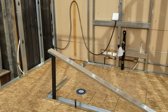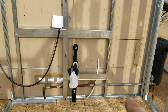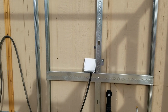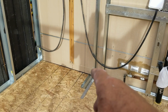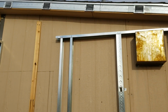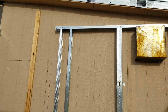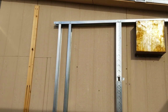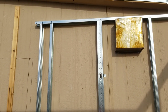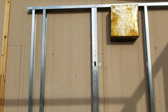All right, bathroom layout. I've got the bathroom laid out here. I started putting the false wall in there, and well, it's pretty much, the false wall is done. I have to go pick up a couple more studs, and I'm going to continue that piece all the way across, but those are 2x3s. I'm going to put a 2x4 plate on top of that, upside down, so that it overhangs into the room, and that gives me something to fasten my drywall to along the edge there when I'm putting my ceiling up.